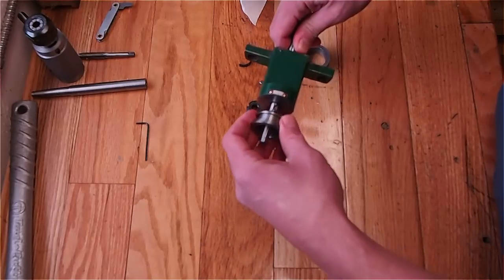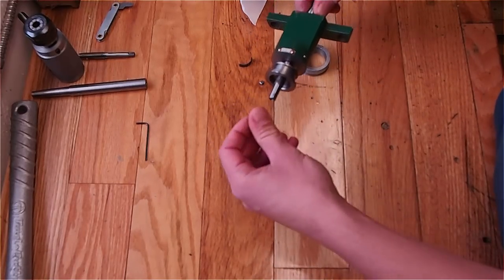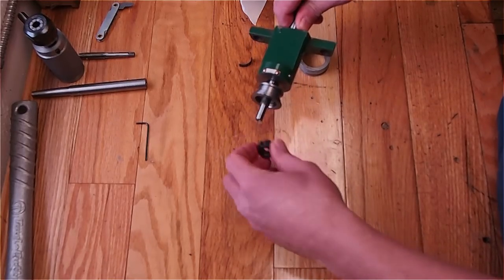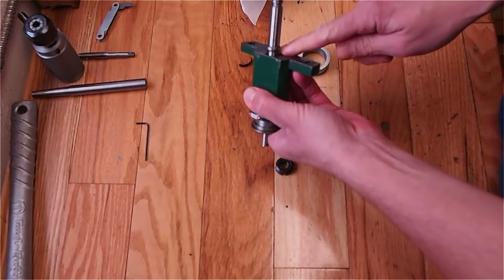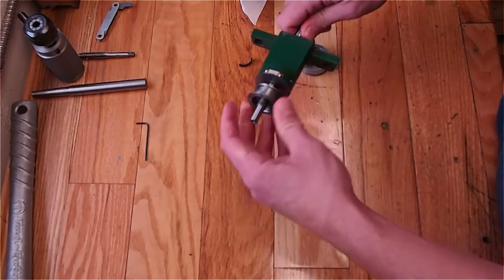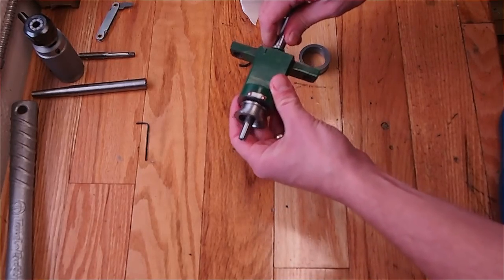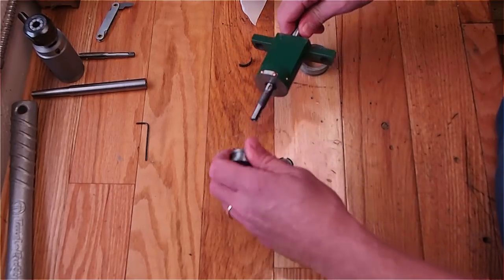collar here. So basically the way this works is you put this all together, you put this collar on, you set the nut, and the nut sets the tension. So if you tighten this all the way down, it's not going to move because this presses against this surface, and then that pinches here and it becomes super stiff. So you back it off a little bit so that it actually does rotate. That introduces play into the system. They did it this way because it's cheap.